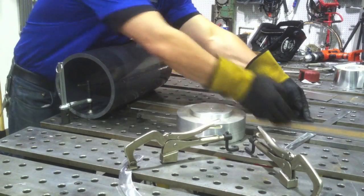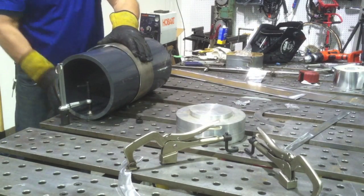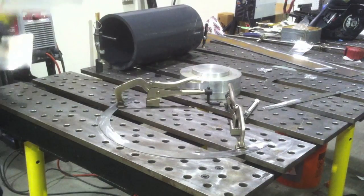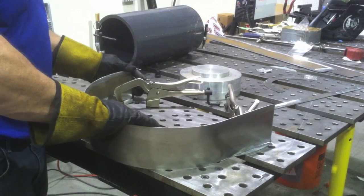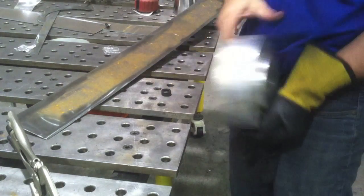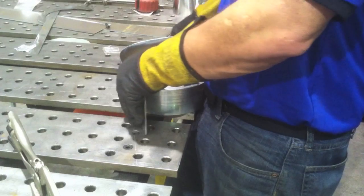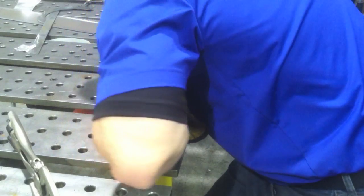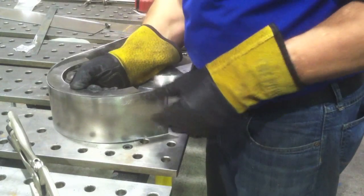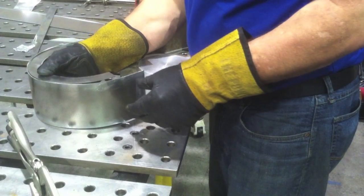To get the rolled radius pieces, I just picked some random stuff laying around that I knew would be a little smaller than the radius I need. I've just got to get it close because this is really soft metal — 16 gauge steel — and it's very easy to form and bend. Just by hand I'm tweaking it, massaging it to get the right radius, then I'll trim the excess. Same on the small piece — I've got a little chunk of aluminum left over from a fixture. It holds itself in place on the table, and this one's strictly by hand. Pretty easy to form.